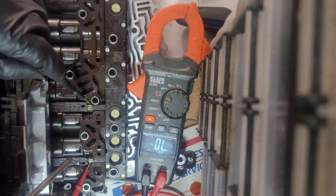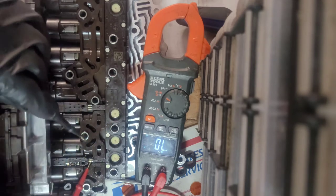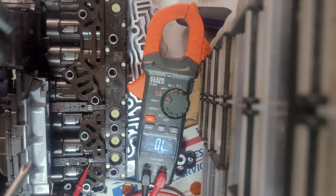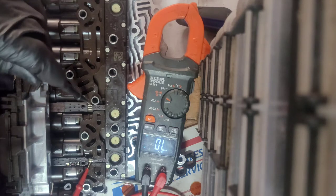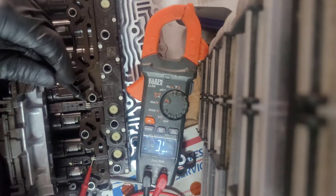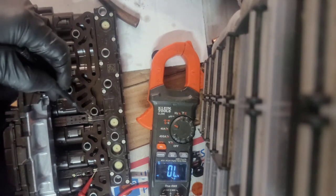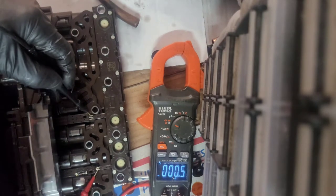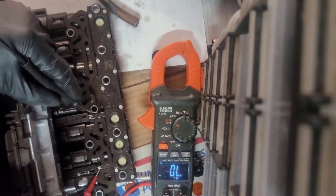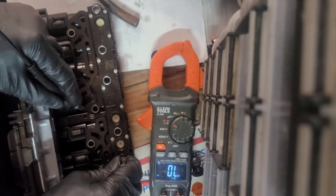The one on the left side is for that one — I believe the second one is for this one, the third one is going to be that one, and the one next to ground is that one. The way you test these is you make sure you have a closed circuit first. Once you know you've got continuity, take something that's not very sharp but small enough to fit in there, press the switch down, and it opens the circuit.